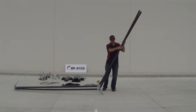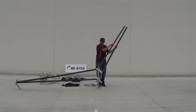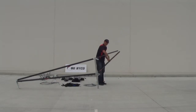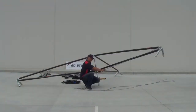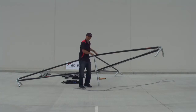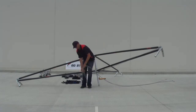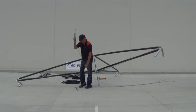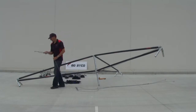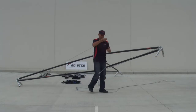The assembly can now be rolled over with the eye of the dropper to the ground. Continue by attaching the corner joiner and long wire to the section. This is repeated one more time, so there are now 3 sections protruding from the dropper. To attach the 3 short wires around the perimeter, loosen the turnbuckles and attach them to the hooks on each corner joiner.